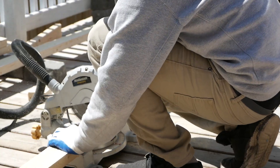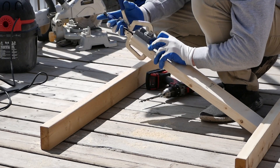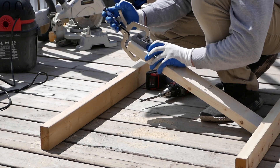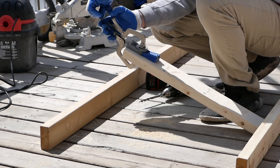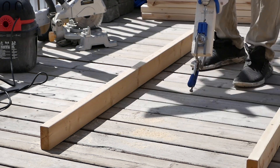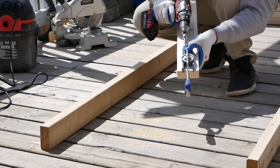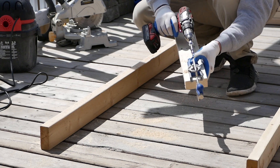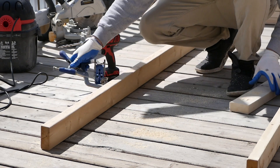The first thing to do is cut all the lumber down in size. The plans for this sectional come with a complete cut list so it was really easy to follow. I followed the plans and just bought two extra 2x4x8s to provide a stop edge for the cushions. Next was a lot of drilling pocket holes using my Kreg R3 pocket hole jig and clamp. I actually got this clamp just for the project and it sped things up quite a bit. I drilled two holes on every frame joint and one hole in each corner to connect the main body frame to the legs.